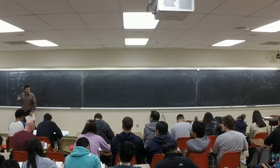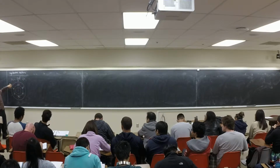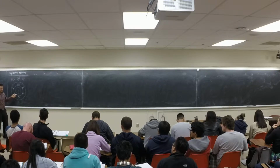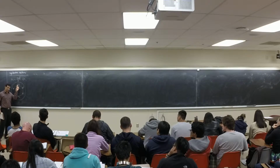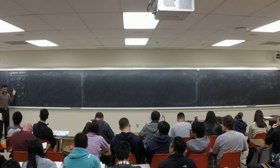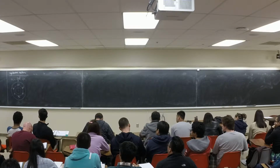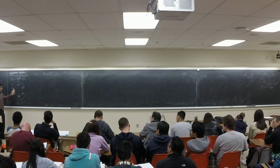But in reality, phase A is not going to be only one slot. It's going to start from here and go all over here, right? For example, 1, 2, 3, 4, 5, 6, 10. Let's say phase A has, I don't know, 100 turns, right? You start from here, 0 here, 2 turns here, 5 turns here, 10 turns here, 20 turns here, and the same thing over there. Basically, we put the 100 turns all over here, but with a sinusoidal distribution, right? That one is for the real machine, when you design the machine. I'm not going to go to that part. So basically, I have a three-phase machine, phase A here, phase B here.